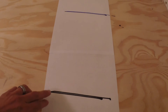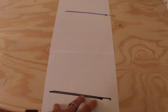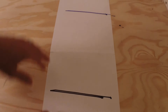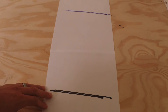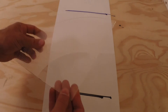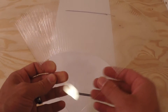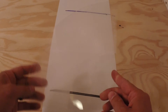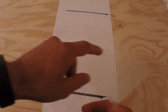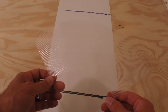Here's what it looks like once my pen marks have been made. This was the backside, this was the front side. The theory is the lengths are going to be different, so I'll use some simple math to figure out the actual turning radius. I've also made a tool — a piece of acrylic that's been laser etched with marks at every half degree up to 90 degrees — so I can measure angles and find the values I need for my math.